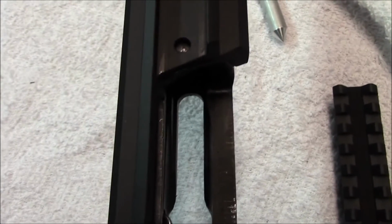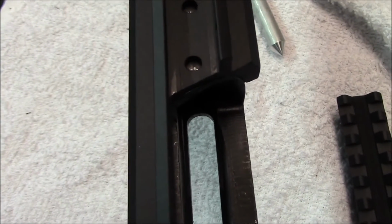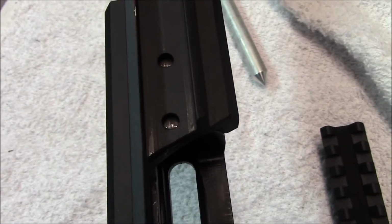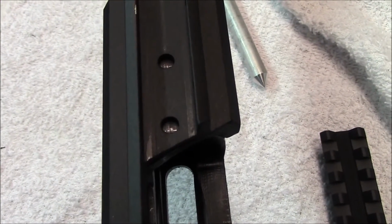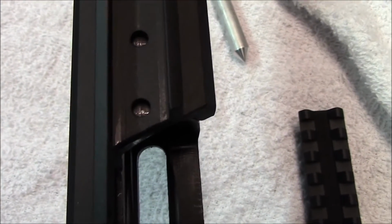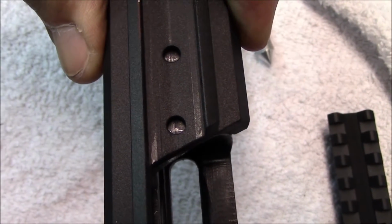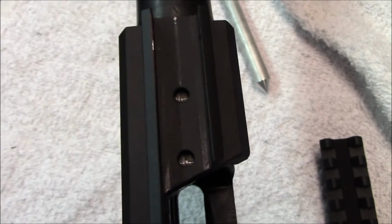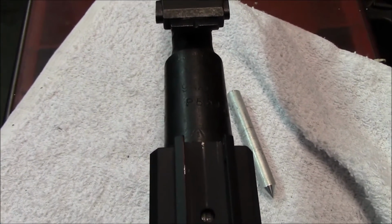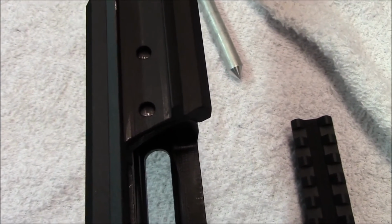and those center spots that we made on the mill with a precision dial test indicator are easily within the center of those holes, within easily 5 thousandths. You can see this. I'm not going to get calipers out and check it, because after 30 years of being a machinist, I think I can guess they're that close. This is going to center you to the bore based on the rear sight. Hopefully you haven't taken your rear sight off. If you have, I think you can reinstall it.